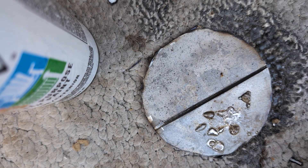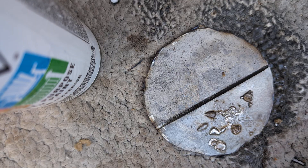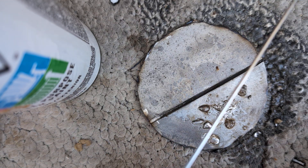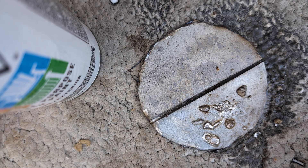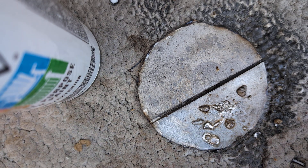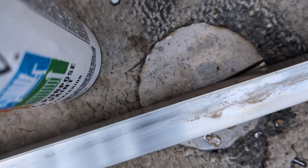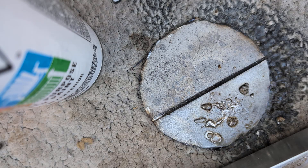So we can actually use plumber's solder for steel — it's so strong, see that! Those Amazon and Temu rods didn't work — they promise you can weld anything and it's not true. They didn't work on steel, didn't work on aluminum, and didn't work on copper. Now we know plumber's solder works on copper, and what I didn't know is that it also works on steel when you put plenty of flux. On aluminum it just rolls off in a big chunk — doesn't bond at all.